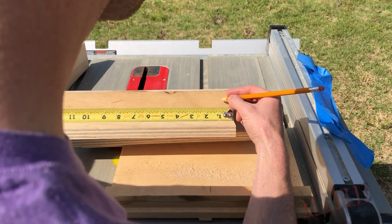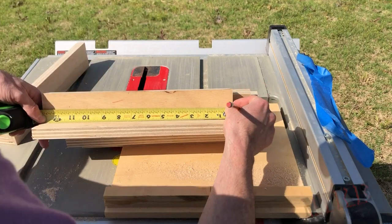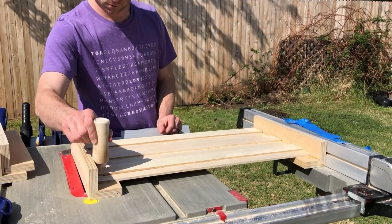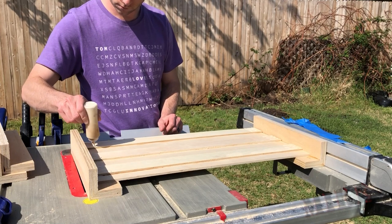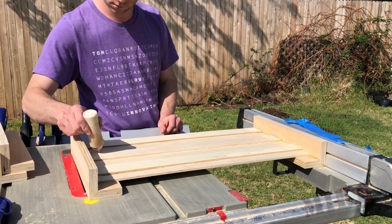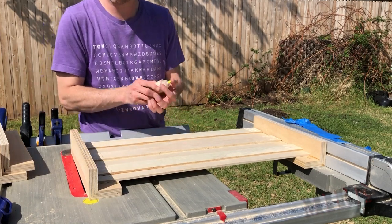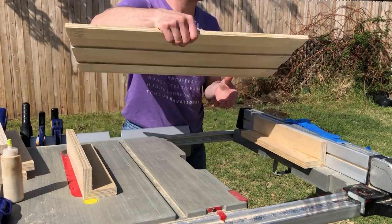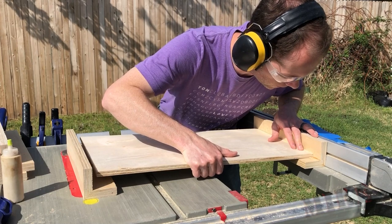Now here's my completed leg that I've trimmed off to 13 inches, marking one inch from the end because this will be where my side pieces stop. I've got some quarter-inch plywood here with some two-inch wide strips glued on top at two-inch intervals. And now I'm gluing them into two of my legs. These are going to overlap on the ends — they're all the same length, these side pieces — so they're going to be staggered by the side width at each end and it'll go around.